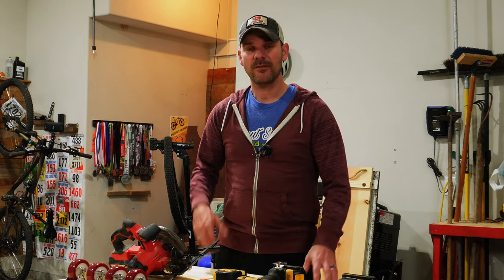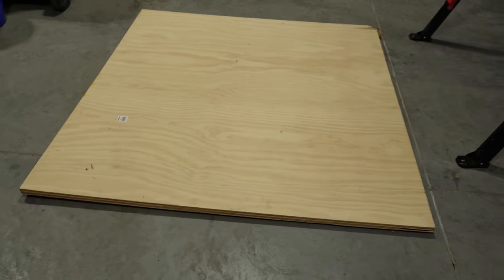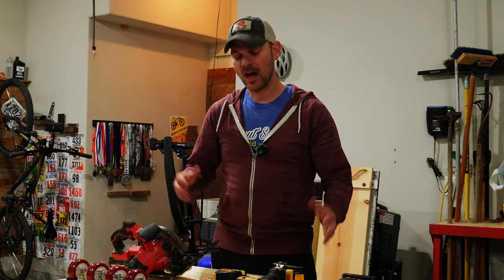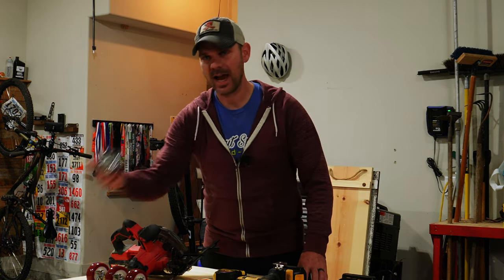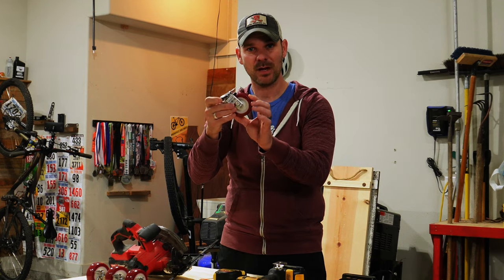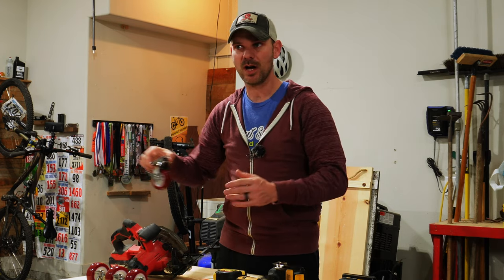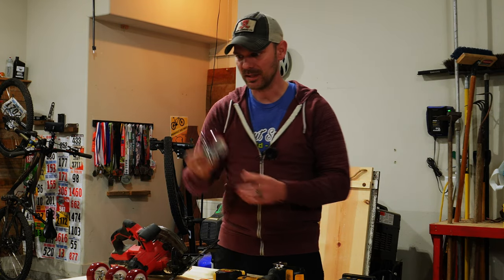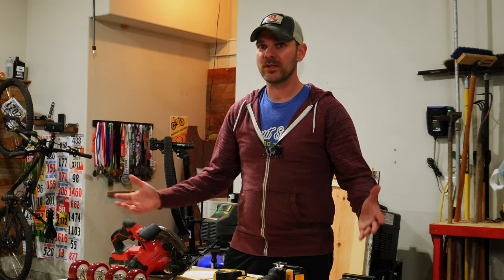As far as materials, you'll need a four by eight sheet of plywood, preferably something with a nice top like birch or oak. In this project, I've got one piece with a nice top on it; the other piece on the bottom is just a construction grade outdoor rated plywood, and that's okay because it's on the bottom shelf. The next thing you'll want are some casters — I bought these from Harbor Freight, three inch casters that can hold about 120 pounds each, with a lock and full swivel so I can roll this around my garage and even outside into my driveway. And finally, you'll just need eight two by fours that are eight feet long. That's all the materials and tools you need — let's get this build started.